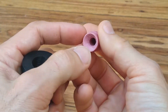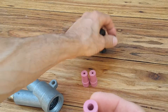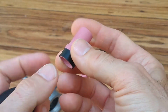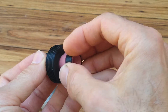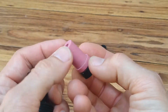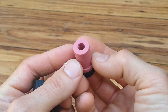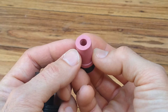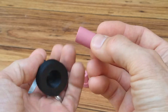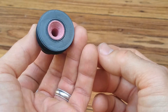What we're going to be doing is use the Harbor Freight inserts along with another little 3D printed part here. This will allow us to put the tip inside of this sleeve. These inserts must come out of some kind of a mold because they're not all exactly the same — you can measure one in three different places and get different diameters. They're a little bit wonky, so you do have to allow some space for these.